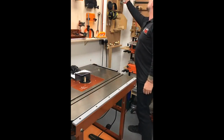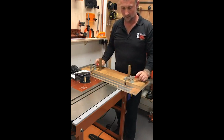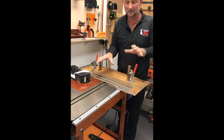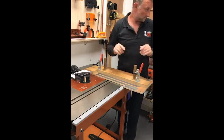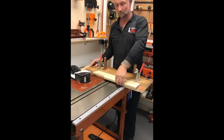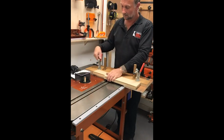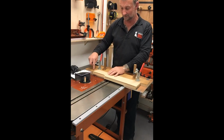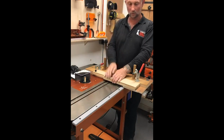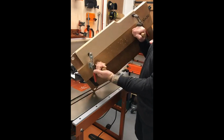I'm going to introduce one of the jigs that we've got on the wall here. Oh, a big one. You can see a couple of toggle clamps, a couple of handles. I've even stuck some gripper tape on there to stop the material sliding about. This is what we need to do: workpiece in and up. Template in and up, making sure that with the register, the datum point, which is up here, and the back are flush hard against our template, locking in place. That is ready to go. It can be really quick and easy to do this.